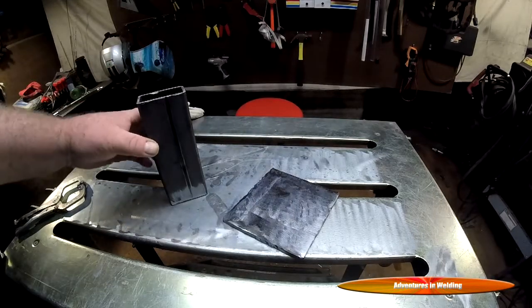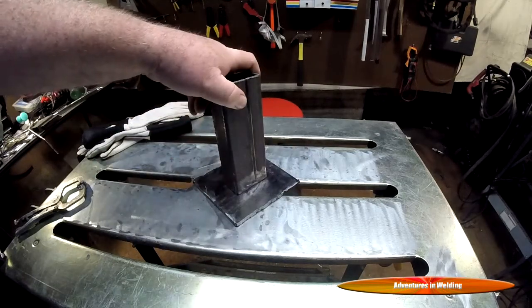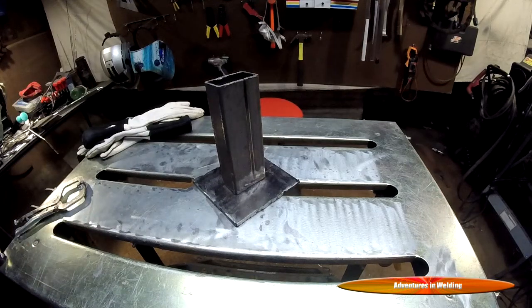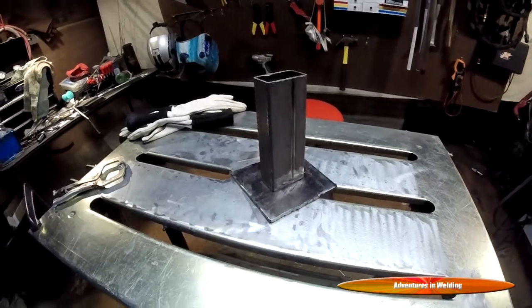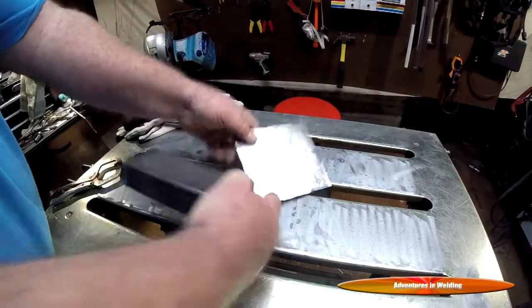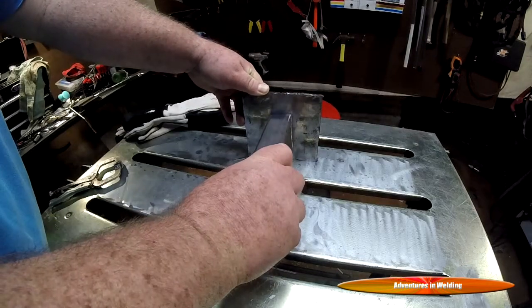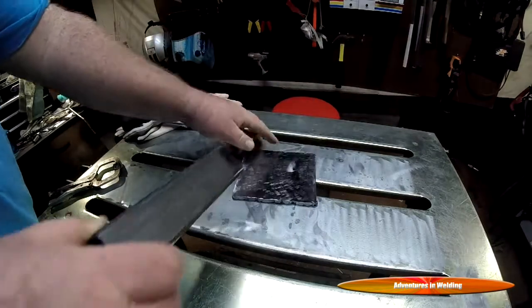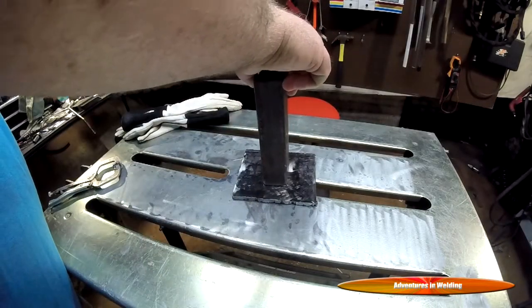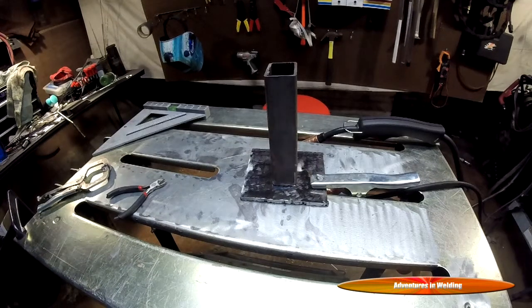Anyway, the joint that we're going to be talking about today is what I like to call a square flange joint, where you're going to be asked to weld a piece of square tubing onto a plate such as that. Imagine, if you will, that we've got this here, such as a wall or something, and we're going to add a joist across it like this. So that's the first joint we're going to tackle today. We're going to hit this with some flux core. We're going to start off by tacking it, and then we're going to hit it up with a 3-bead fillet weld.